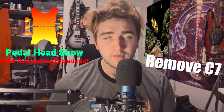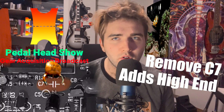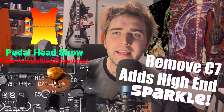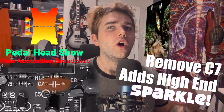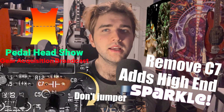Okay, now the next mod we're going to be doing for the Boss TR-2 is removing capacitor 7, C7. This capacitor is about 10 picofarads, and you want to remove it completely, or you can lower it. What exactly is C7? It's a low-pass filter, cutting out some highs to give more of a throbbing sound. If you remove it, all of a sudden your distortions have a lot more presence and brightness.